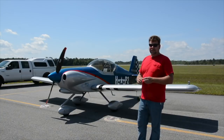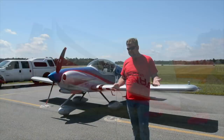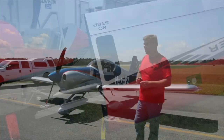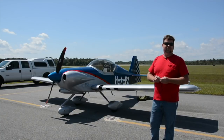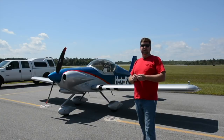It has folding wings that one person can fold in about three to five minutes. You do have to disconnect the fuel but don't have to drain any fuel tanks, so it's a simple wing fold that some people find useful. The latest addition is the tri-gear. The tail dragger has been flying for about five years, has been well received, and there are about 20 flying to date.